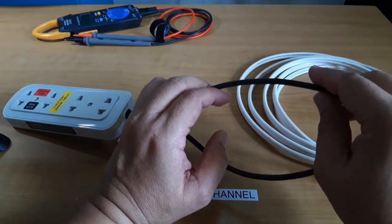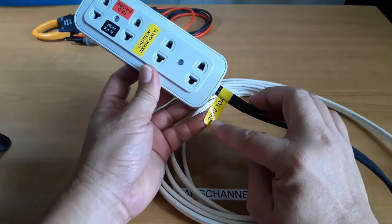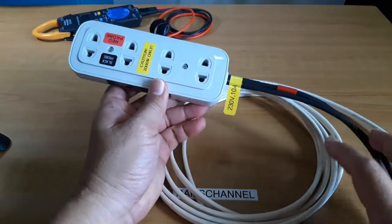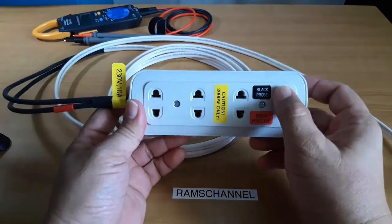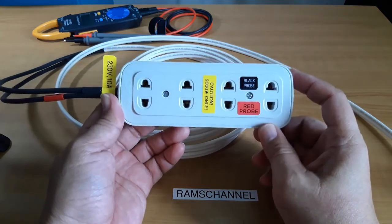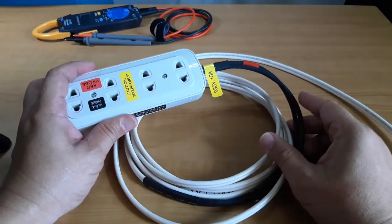To the cable whenever you insert and remove your current clamps. The labels are important to me — this one is a flag label, a caution to remind me that this outlet can only accommodate 2000 watts maximum. These are also labels for black probe and red probe, because if your meter is capable of measuring not just voltage and current but also power and energy, you need to orient the voltage probe and the direction of current flow in order to measure those values properly.